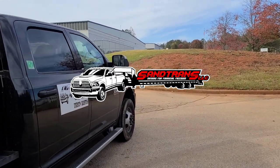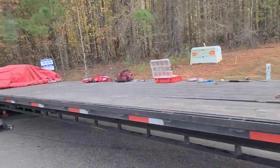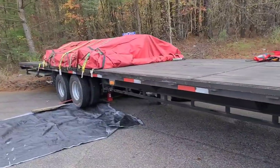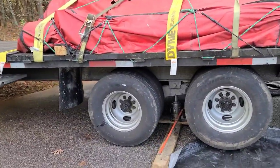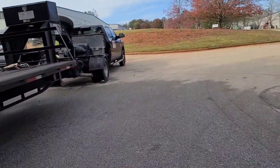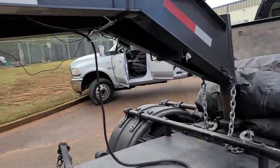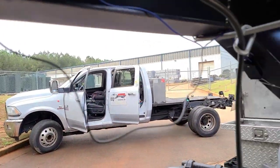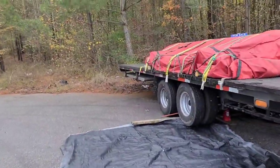What's going on YouTube, this is your boy Stacey with Sand Trans LLC where we're driving for financial freedom. I'm back with another hotshot video and today we are doing brake maintenance and brake repair on a trailer. The brakes were not working — it's a combination of things: wiring, the brake booster, the hubs, packing bearings, and also replacing the electromagnetic on the brake assembly. It burnt slap up due to electromagnetic failure inside the brake assembly.